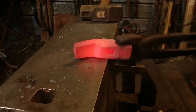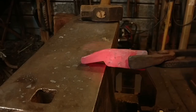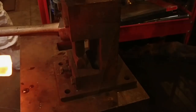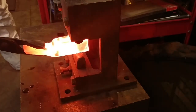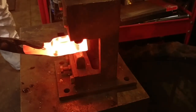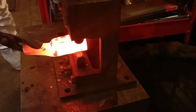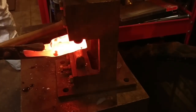As you can see, we're pulling that out. Essentially this is just wash, rinse, and repeat until you get the claw portion of the hammer out to the distance that you want. Now we're going to flip this over and do the same thing — move about a half inch, or 12.5 mil, off of the eye of the hammer. Then we're going to hammer in where we're going to segregate out the hammer face itself.